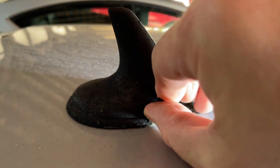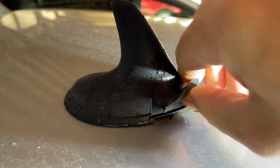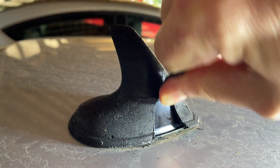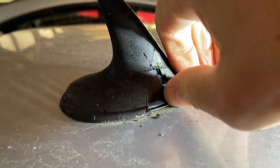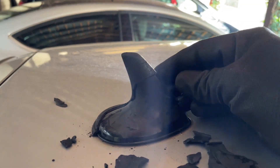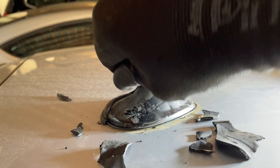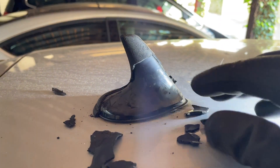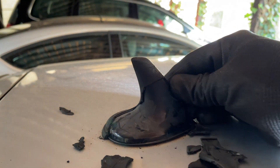I've made a few cuts with the utility knife and you can see this is just going to peel off — this is gonna take a little paint but this is the general idea. I'm going to peel off this outer cover and expose what's underneath. Hot tip — pun intended — use a heat gun. That'll definitely help loosen the adhesive and get it up. I was struggling without it and I just put a heat gun on this side and it peeled off so much easier, so I'm going to continue doing that on the whole thing.